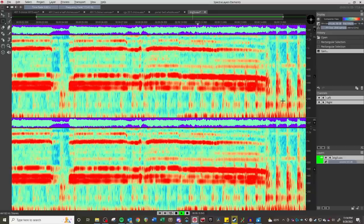The interesting thing to note about this is where I learned that the different chamber lengths get affected by the steam differently. Where when the whistle's blowing hot up here, and it almost sounds like a major chord, you have 320 hertz in the lower chime, 390 hertz in the middle, and 505 on top. But then here towards the end, when things are fading out, you have 300 hertz, 377 hertz, and 475 hertz. So the top chime is wandering further than the lower chimes.